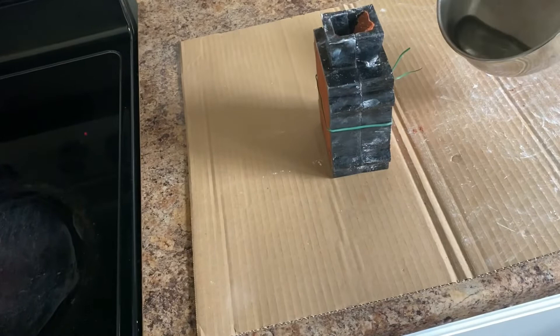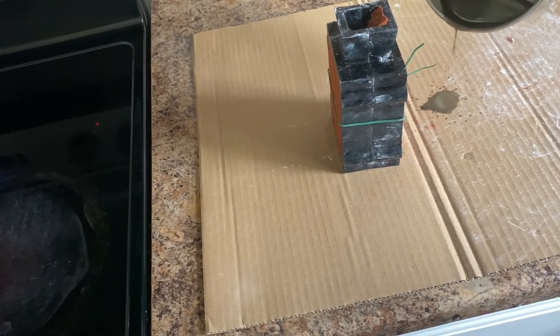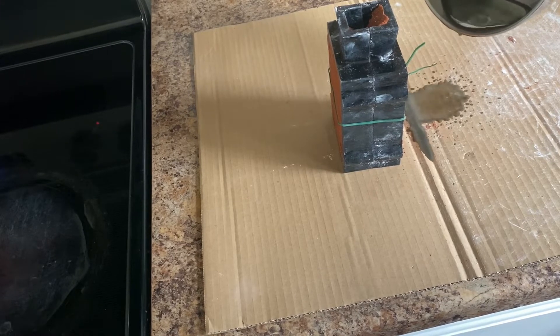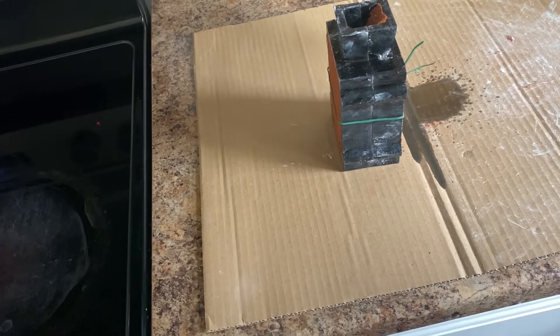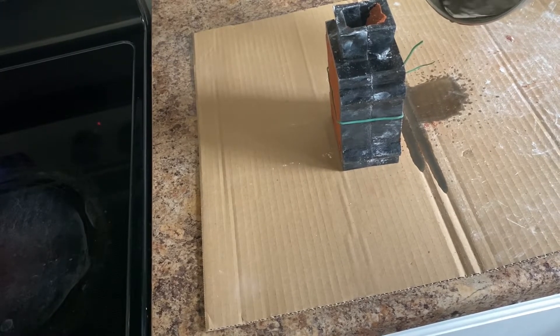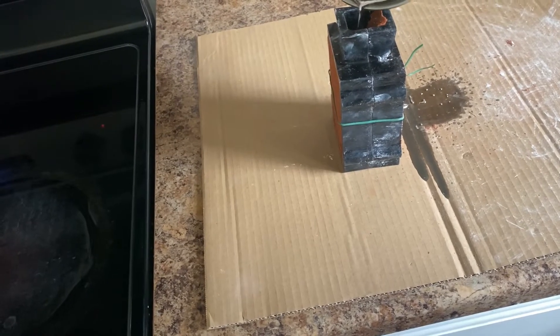You can't really see what I'm doing here, but I'm trying to pour off the oil — I don't want the oil to go in my mold. So I want to make sure I get a clean pour of metal, a clean pour of this liquefied bismuth-tin alloy. I'm slowly dripping off this oil. It'd probably be better if I had something prepared to pour this into, but this piece of cardboard works fine. And now I'm to the metal, so I just pour into my mold.